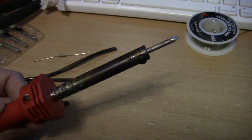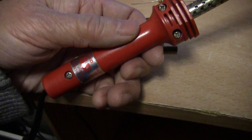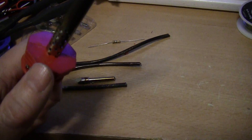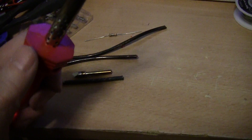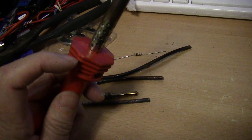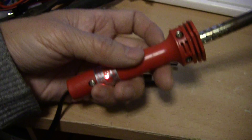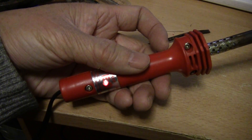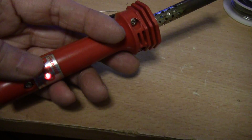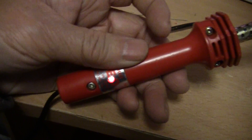This is the finished product. I have a new tip that I tinned, and over here I have a red LED so that I know this is still plugged in. I didn't put the LED near the heating element — some soldering irons have a white LED there, but there's simply not enough room inside, and that area gets pretty hot being close to the body. Just make sure you know what you're doing, because this LED is running off the AC mains. Don't open up the soldering iron when it's plugged in. Thanks for watching.